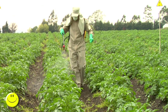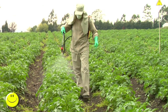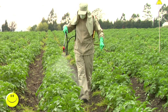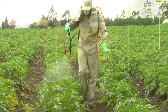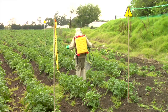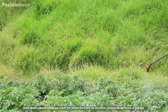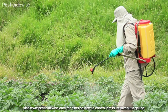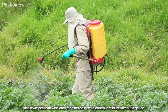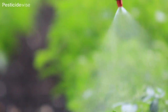If you are spraying a band or row, spray only the target surfaces. For instance, adjust your swath width so that you only spray the crop row or the row of vegetables. If possible, spray with the wind at your back, blowing from you towards the nozzle. Monitor your spraying pressure and keep your spraying speed constant. Constantly check that your nozzle is producing the right spray pattern and drop size. Check that the spray is reaching the target surfaces.